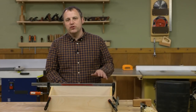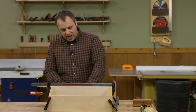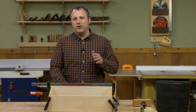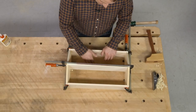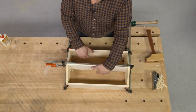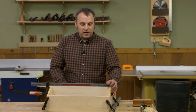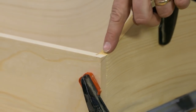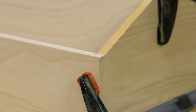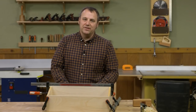Just before I walk away, I'm going to double-check to make sure that this is square, then I've got to wait for the glue to dry before we can move on. A couple of key points to highlight: when you download the original plans, this center divider runs all the way to the bottom of the ends. In my research, I found that on the original tool totes these were modeled after, the divider stops a little bit from the bottom — that way you have a large well for larger items down in the bottom of the tool tote. Once the glue is dry, I'm going to use a hand plane to make the bevel on the sides match the slope on our end pieces. This is fir, so it's going to plane really easily — frankly, it's going to be a lot of fun. On our next video, we're going to add the bottom, the two lids, and a sliding tray on the inside. Stick around.